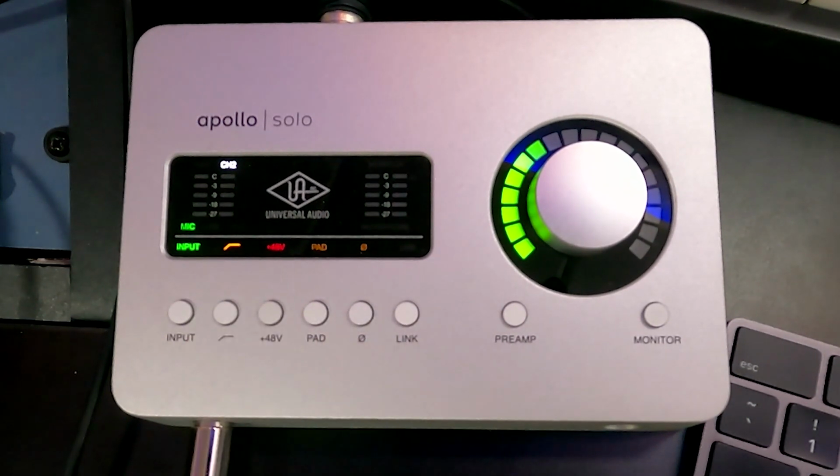The high pass filter, what this does is many microphones have these and many microphone preamps have these, because what it does is it removes low end. So it allows the high frequencies to go through, and all the real low end is filtered out or removed. The reason why you might want to do that is in the case of a vocal, especially for example a female vocal, or perhaps an acoustic guitar, there's not a lot of low end fundamentals in the sound.